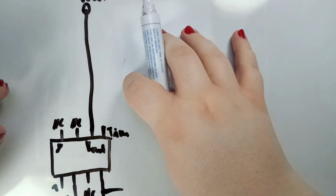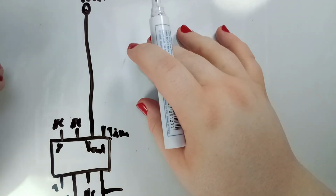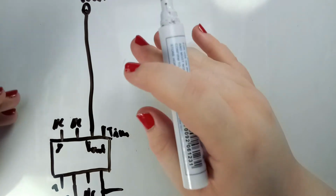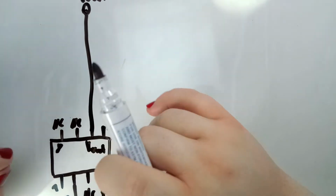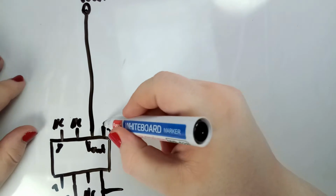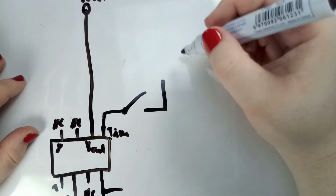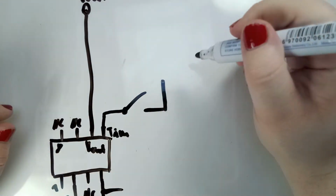The whole trimming circuitry, if you're not going to use it, it's unnecessary. If you want to use it in the future, you have to come up with a way so it's not connected right away, and the easiest is to just use switches. And I used 4 switches in total to make sure that I completely disconnect the trimming circuitry from the IC so it does not influence its operation. So the trim pin, in my case, goes out into a switch, and so the circuitry, you can completely exclude with the switches if you can trim it.